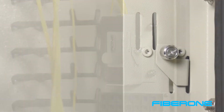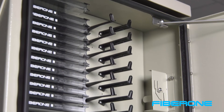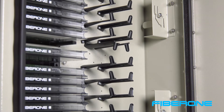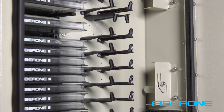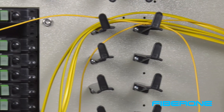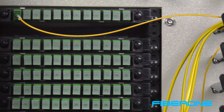The retention bar can be placed in multiple positions as you add more splitters. Between the splitter holder and the cassette are a pair of fiber support arms. Slack fiber will be routed around these in a counter-clockwise fashion to connect to the appropriate cassette. There are 7 sets of fiber support arms pointing in the upward position and one on the bottom side pointing in the downward position. Ideally, you will route all the splitter outputs from the splitter holder to the cassettes in the adjacent frame.